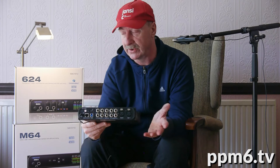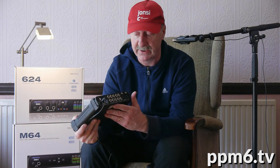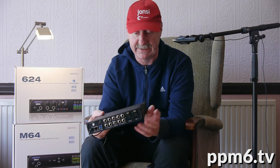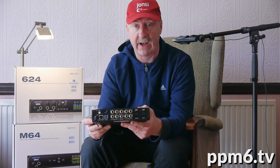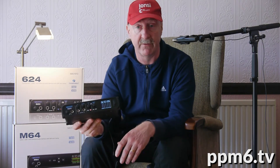You can add device upon device up to your five ports, and MOTU have a huge range — stage boxes, monitor mixes, analog inputs, digital inputs of all manner. I've also got another video on the M64, which is a great MADI box that also supports AVB TSN if you've got MADI kit to integrate. If I was looking at this as a standard off-the-shelf USB 3 Thunderbolt interface, I'd say it's a little expensive — particularly given only two mic inputs. But what's really attractive is the opportunity to extend your investment over AVB; you can add more mic preamps, digital I/O, whatever you need. It's an interface you buy and enjoy now, with great protection of your investment for the future.